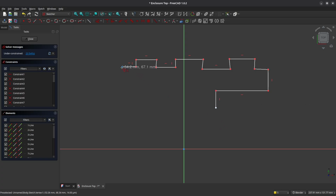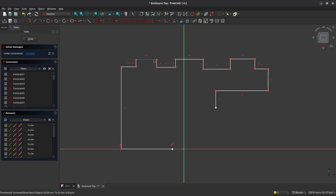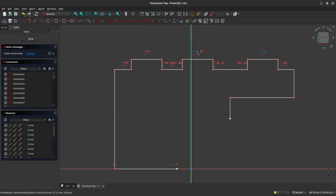I'm going to move back over here to the other side. I'm going to bring this right down to the x-axis and over. All right, we'll close this off with an arc after we clean up the line segments that we created. So that should do the job there. Okay, and as always, let's set our tabs so that they are the same width. And we'll set the sides so that they are of equal height. We'll make the center tab so that it's symmetric around the y-axis.